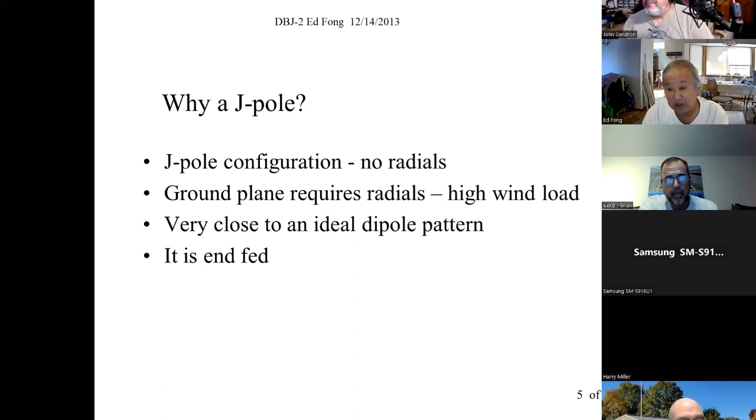Now, it's 50 ohms impedance at VHF and UHF, but typically it's a 0 ohm antenna. So it grounds itself to the shield, which means it can never hold charge. A regular antenna, like a dipole, can hold charge because it's an open circuit. So if you have a lightning storm 10 miles away or even a mile away, it can easily induce 30, 40 volts, and you burn out your front end, because it's not a DC shorted antenna. A J-pole is. That's a real advantage, that it does not hold charge for very long.